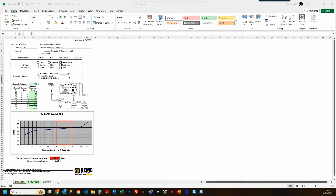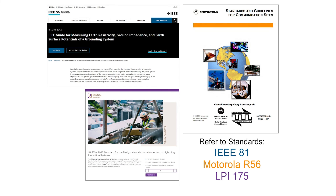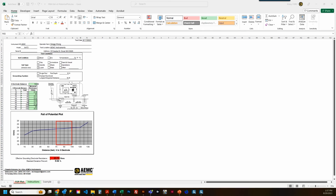If you need more information regarding validating your test results, we suggest referencing our Understanding Ground Resistance Workbook at AEMC.com, or applicable standards and guidelines like IEEE 81, Motorola R56, or LPI 175. The effective system resistance is calculated by simply averaging out the midpoint measurements into one system resistance. The effective system resistance of our ground ring is 23.73 ohms. This report is now ready to be submitted for review. I'm Greg — measure up with AEMC Instruments.